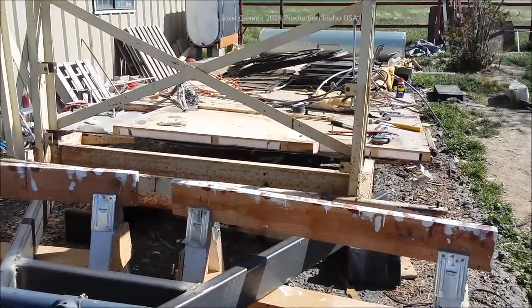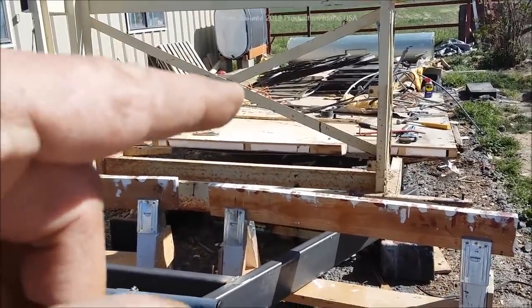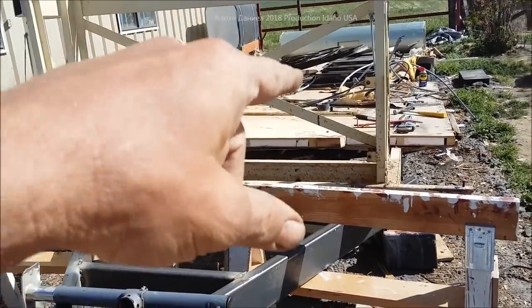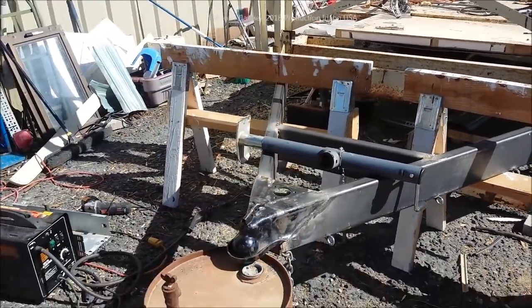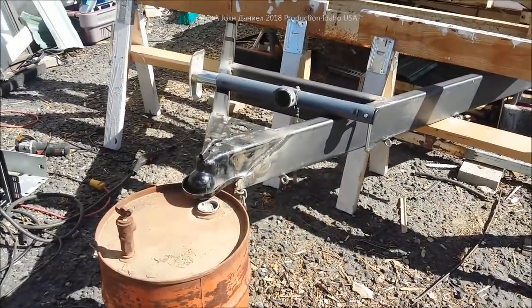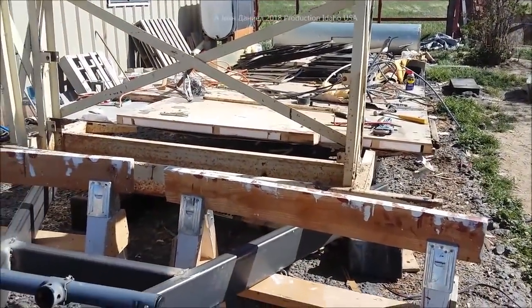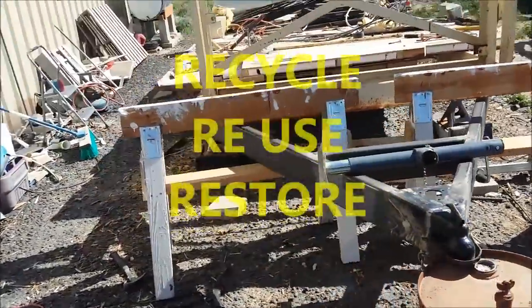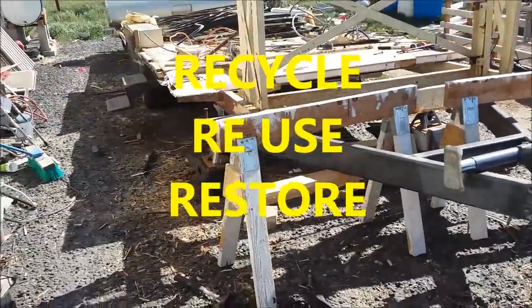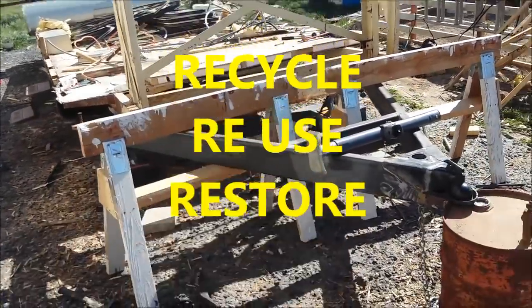There is the salvaged fifth wheel RV with a 24.5 foot finished deck, and it will be dovetailed. The last 2 feet will be dovetailed, and at about 22 degrees, to make it a little easier. But not bad, guys. I think I'm gonna have a grand total, including all parts going into it, somewhere in the neighborhood of about $550. So you can't buy one like that with 6,000 pound axles, but you can build one. All right, watch for the second video one of these days, not too far off, on my channel.